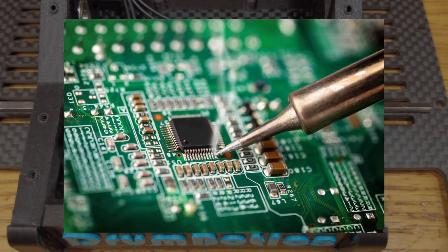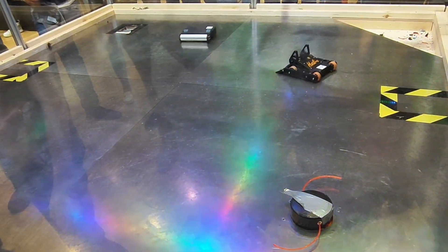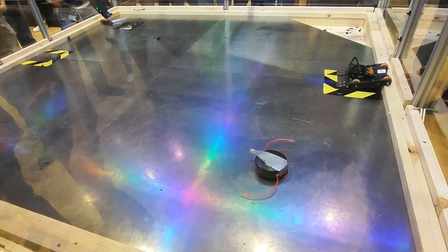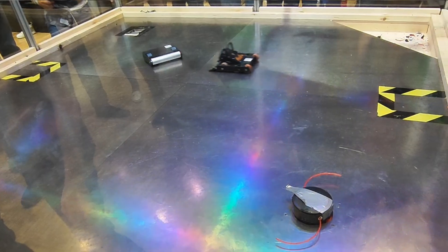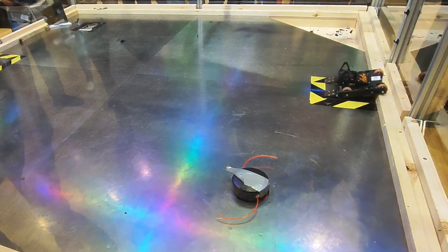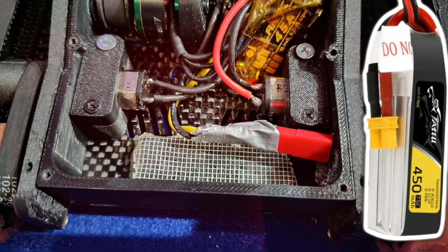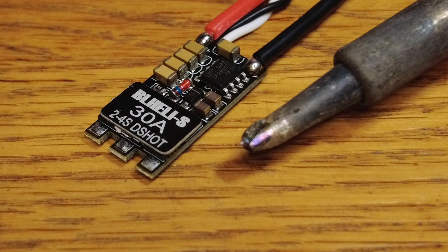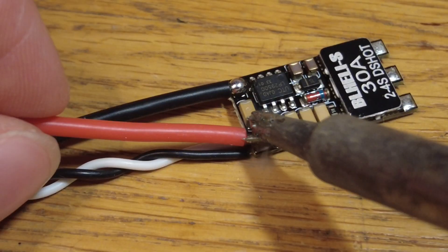Let's get back to the electronics. Last time in Latvia, we all remember what happened — I lost, and the reason was that a wire lost contact with my battery and stopped working. Now I was extra focused on my soldering. I used soft 22 AWG silicone wires to connect everything.